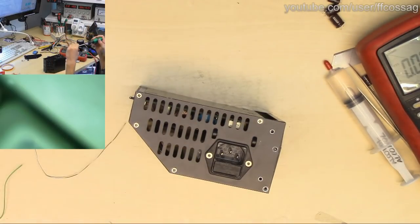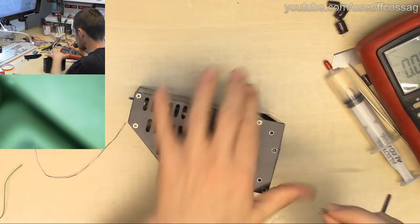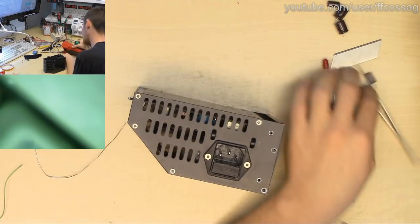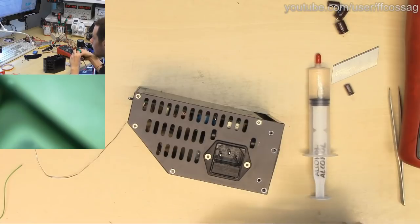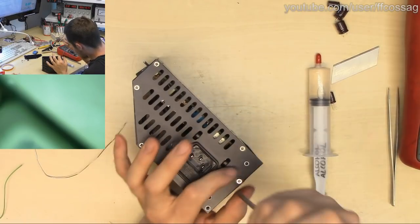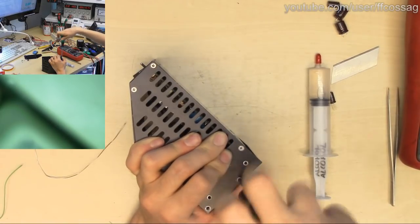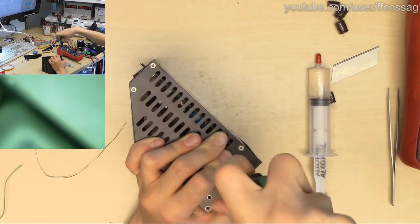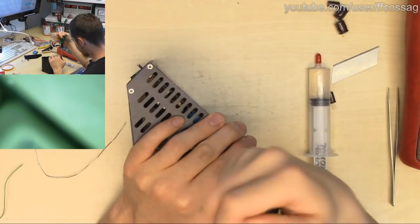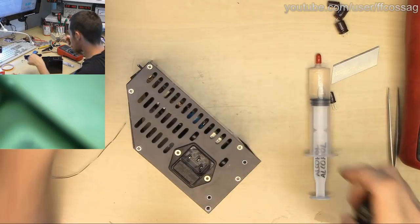These are more resilient usually to bad power grid supplies, since they have a big transformer which is fat and slow connected to a power grid, so any small spikes are usually just going to go away in the transformer rectifier setup, and there's very little risk of damaging any early 80s style primary side switch mode IC, which would be a very delicate sensitive flower. So for the time, these were not that bad. They were not that much less efficient either, since 80s switch mode power supplies were not marvels of efficiency. How do I know it's 80s? Just look at it. That aesthetic though.